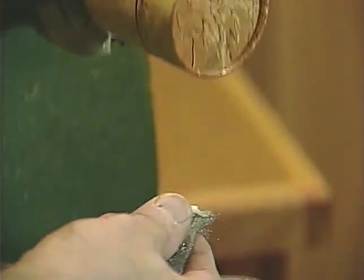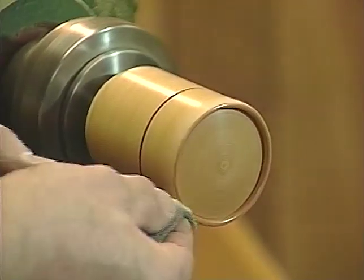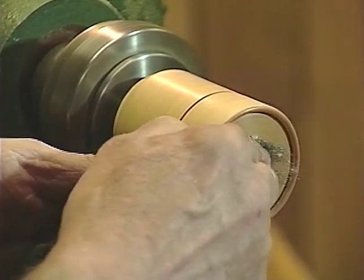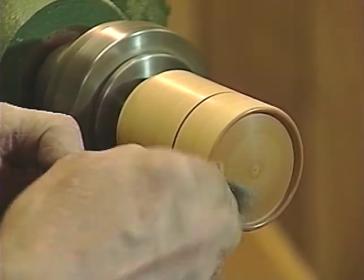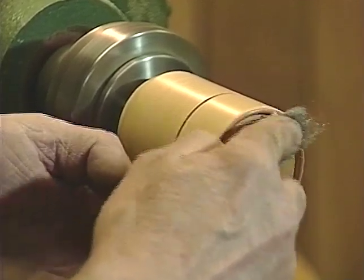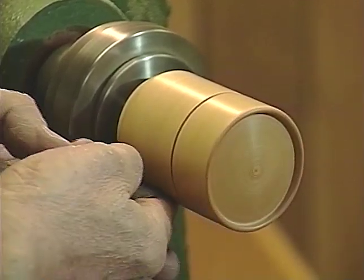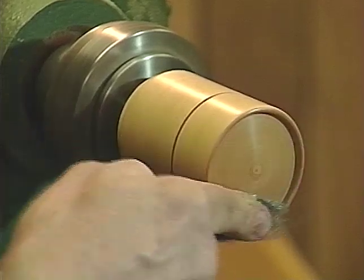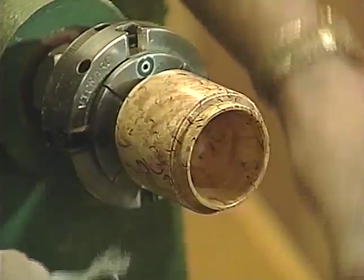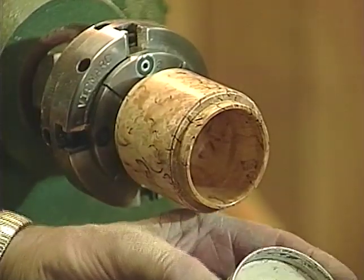Now we've put the lacquer on, this needs to be cut back with the steel wool again, dipped in the wax. This helps prevent the build-up of the sealer. It minimises the friction heat. If you just use the steel wool dry, it could drag the lacquer as it may not be totally cured. By this method, this eliminates this happening.